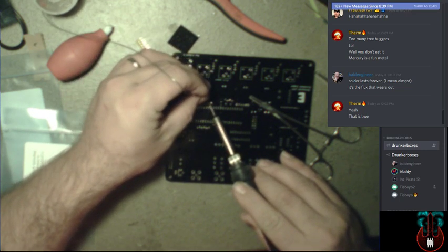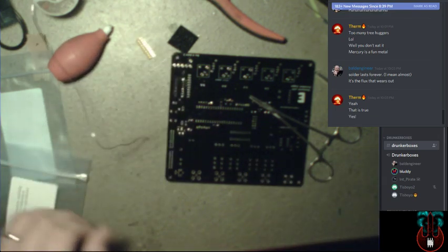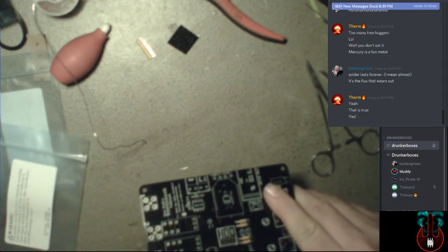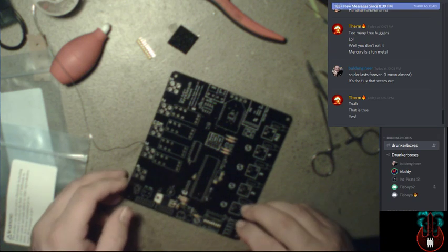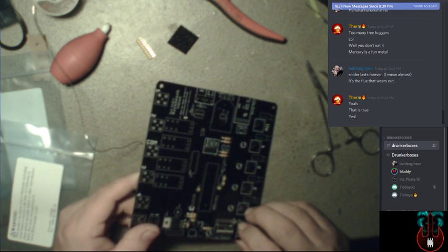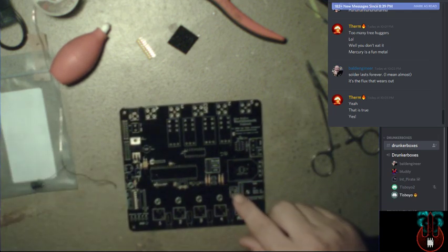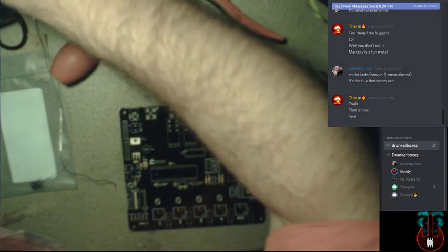The LED ring box that we got from Hacker Boxes, I ended up accidentally soldering all of the surface mount LEDs backwards, so I had to desolder every one of them and redo them. That sucks. A couple of them I had to replace with a larger chip because when I went to desolder it, the LED completely split in half. The bottom part just ripped off. I think if I had to desolder a bunch of surface mount LEDs, I would have thrown it in the trash can. I'm far too persistent for that.